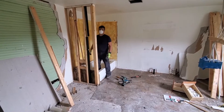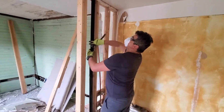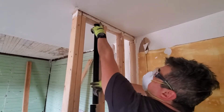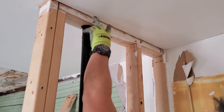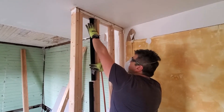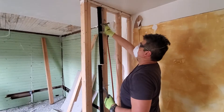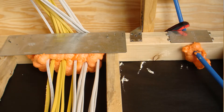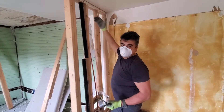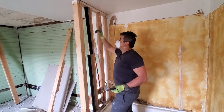Here's a really common problem when building codes aren't followed. I can't pull this ventilation line out because somebody perforated it with a screw. That's why you need to install nail plates — I'll show a graphic on screen. The same applies to water lines: you need to protect those pipes. If this were a water line on the second floor, you'd have water dripping and causing damage. Any time a pipe runs across a stud, make sure you put a protective plate so you don't drill through it. This is a great example of something that can cause rot in your house without you knowing where it's coming from for a year.